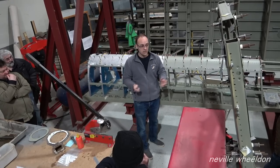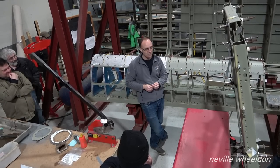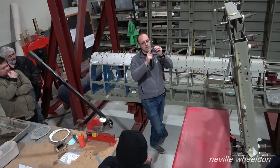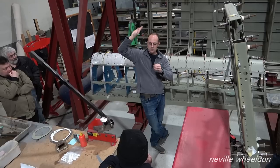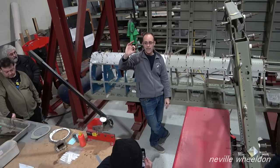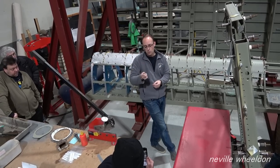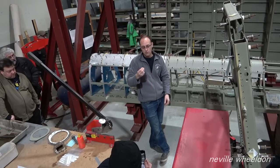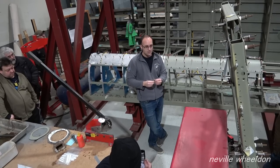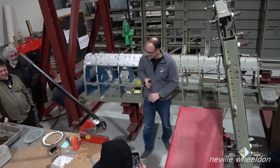You may have heard about the Canadian Lancaster wingtip folding up in flight a few years ago. The crew looked out the window to see the wingtip hanging up in the airflow — that was due to these studs stretching and snapping, allowing the wingtip to fold up. These are made of a special material — we've had new ones made for the wingtips and will have to have new ones made for the trailing edge as well. A few have snapped as we've undone them, or are corroded to the point they've lost enough strength to require replacement.